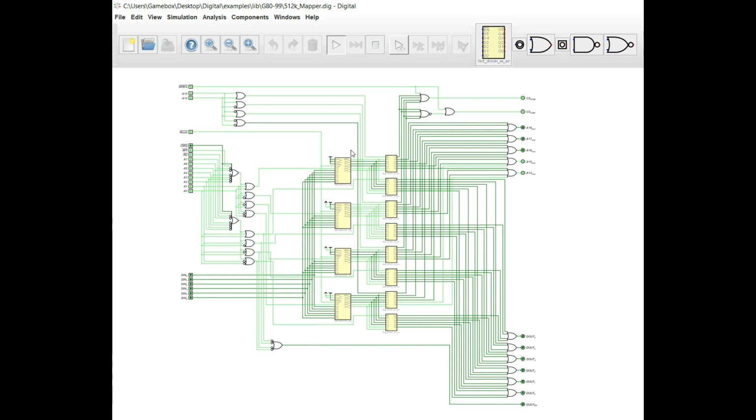Like I said, I think that there's 24 flip-flops here, which means that we're going to use at least 24 macro cells. But the rest of this, to be honest with you, I think would probably fit in the macro cells that we've used. I don't think that we're going to use up all of the discrete logic within those macro cells. So I think that this would be a very safe bet whenever it comes to expanding.